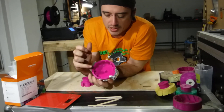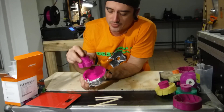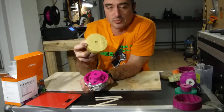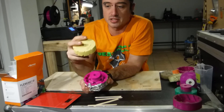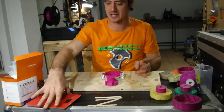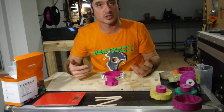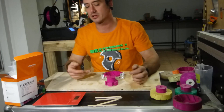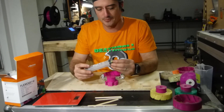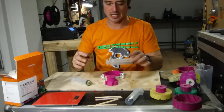There's a little spacer in here, 3mm high, that will keep the base of this off the mould — so it will give you 3mm of material on the bottom. Because if you didn't do that, there would be nothing on the bottom, it would just be flat. So the polyurethane needs to be added in equal quantities — you can weigh it or measure it. I've got some syringes with part A and part B.